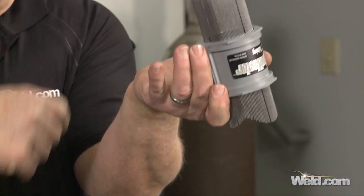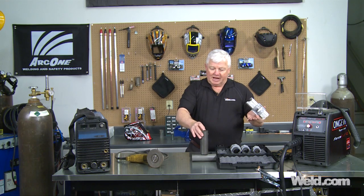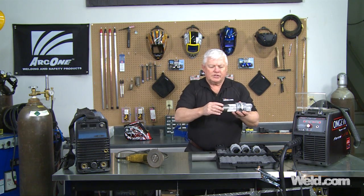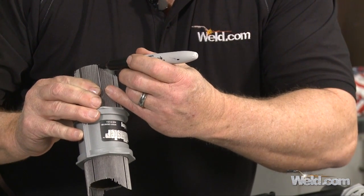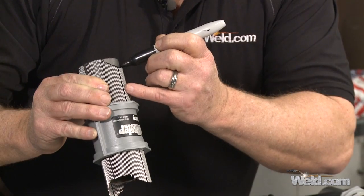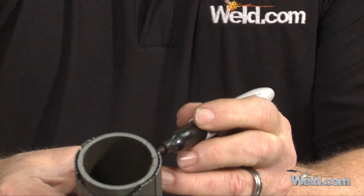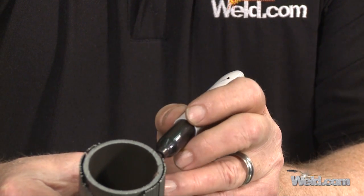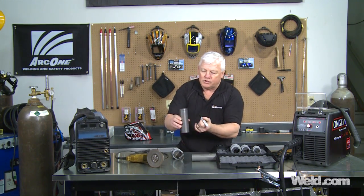And what that will do is give you the shape of your saddle. Now, we're going to want to weld this, but you can see that right now it's got a major gap to it, so it's just impossible. So what we do is we slide this inside the tool, take a sharpie, and you can see I can make a nice little contour here. I'll do it on both sides. And that's really all there is to it. I've got the shape — like a smiley.